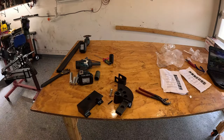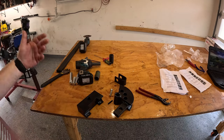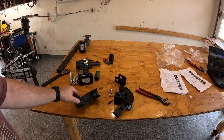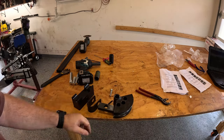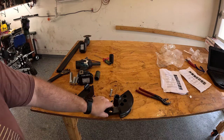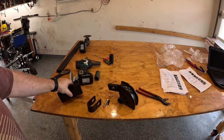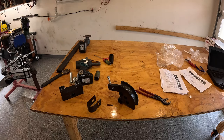Here are the pieces that come with our die. I got this from Kaka Industries - they make fairly inexpensive dies. This is a 120-degree die; a 180-degree die would have been ideal but that would have run about $500 instead of the $185 this was. The die is made of three key pieces: the strap, the die itself, and what I think is called the follower tube - this is what allows you to make kink-free bends. This all has to get installed onto the tubing bender before we can finalize dimensions. The die comes with a bolt and a roll pin that gets hammered in as a stop, and a screw to set your final stop distance.